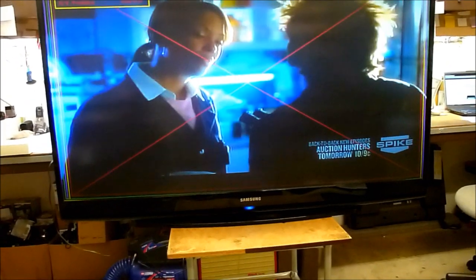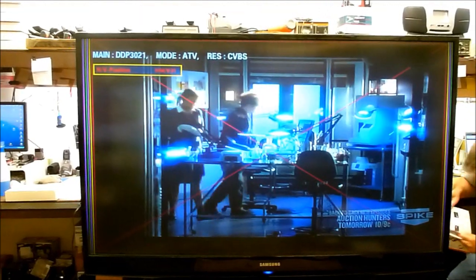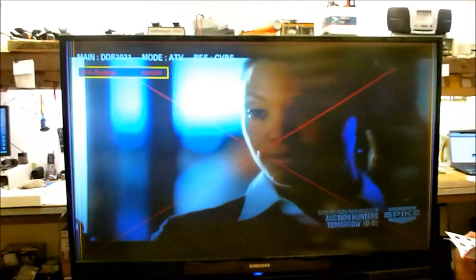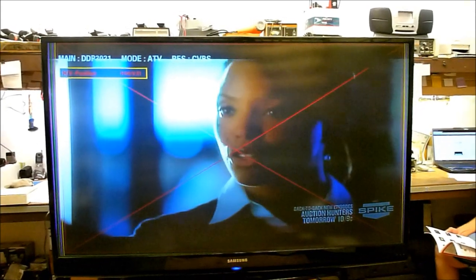It's still pretty close, but on these models, you can actually adjust the top mirror on these sets. There's four screws that you can loosen on the back of the TV, four Phillips screws, and then on the right and the left-hand side, there are two slotted adjustments that adjust the tension on the mirror itself.